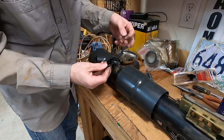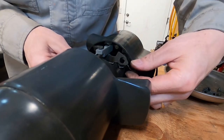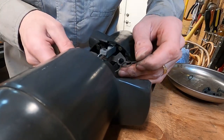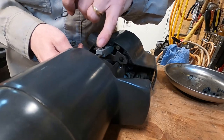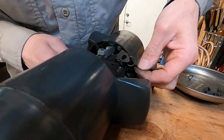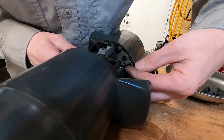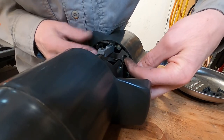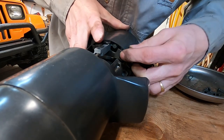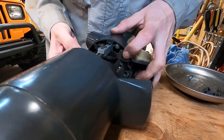Next we're going to work on our key release here and a spring and another little washer. This is a little bit of a puzzle to get together. The key release goes underneath here and this little tab kind of hangs on to the top of our rack. This spring actually is going to go behind here and tuck right into this little spot, but the bottom of the spring catches the key release right there. So kind of put them together, get that spring over that little round spot, push this side down and slide it over. So this spring is underneath the little release there, and with this held on tight we have tension on our key release.